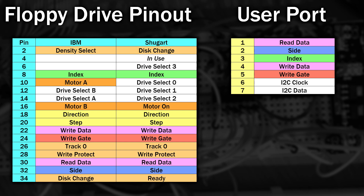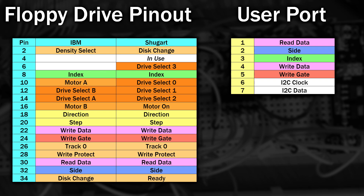The next pin to look at is the motor pin. Typically after switching on the motor, the drive requires around 500 milliseconds to get up to speed, so that's much slower than the speed we're going. Ignoring the in-use pin, this leaves drive selection. For the most part this shouldn't be an issue either, as it's got to be set before the use of any of the other pins. So long as the sequence of pin changes stays in order, we should be good.